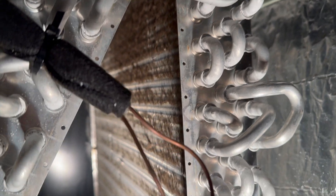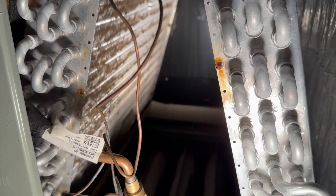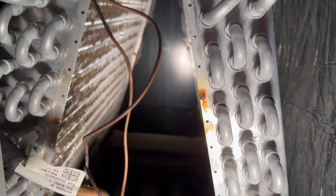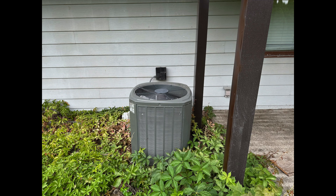Indoor air quality is horrible compared to outdoor air quality most of the time, unless you've got smoke or something outside. The things that come through the outdoor coil are mostly dust, a few leaves — and even then, this unit has louvers on the outside and leaves usually don't get inside them. I've actually let local weeds grow completely around my outdoor unit, checked the head pressure, then cut them away and checked again — it was the same.